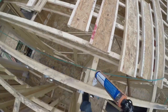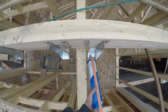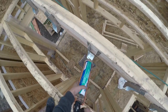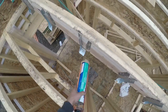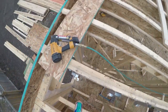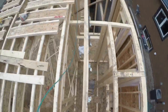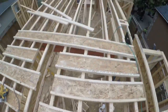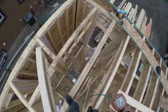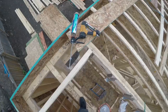So now I'll take my glue, put a little bit in each hanger, and then I'll put all my joists in here and nail them to that wall with this gun. I'm just going to give these a stomp.